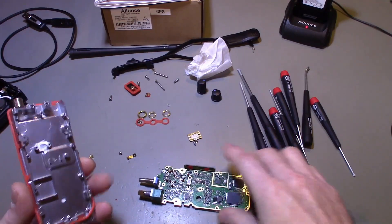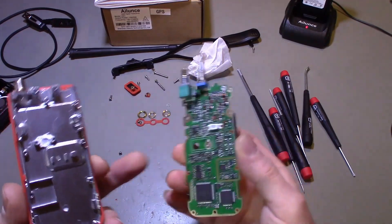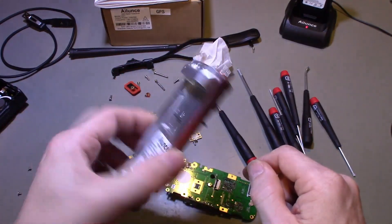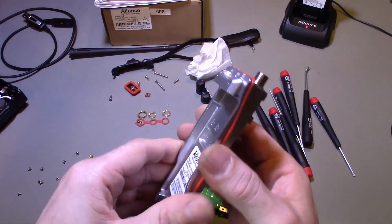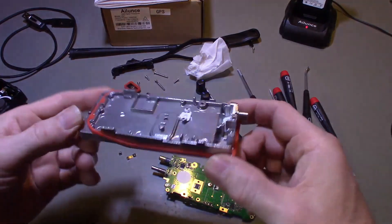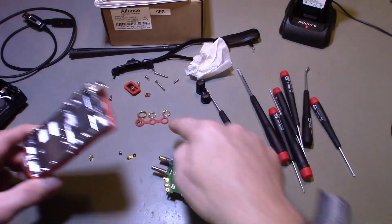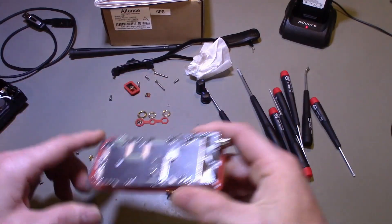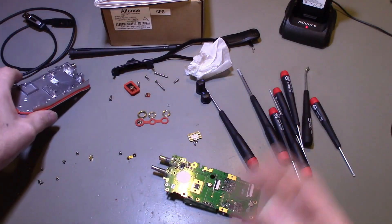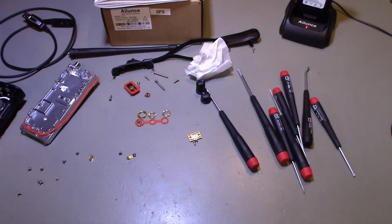You do need to take the heat sink off of the final transistor — actually a MOSFET. That little cover has two screws that go down through it, and the other side makes contact with this nice heavy die-cast piece of metal. This acts as the inner interface between the front of the radio and the battery pack, and also serves as your heat sink. As you can see, everything is gasketed for weather resistance — gaskets around everything, the battery pack connector terminals, all of it.